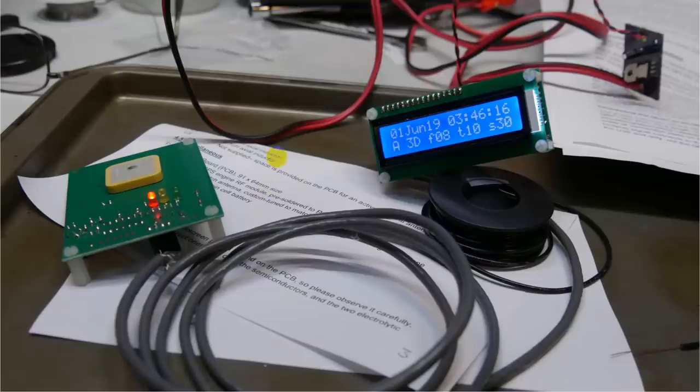Here is the finished clock. You can see the cable that I used here. And this is a little 5-volt regulator. We've got 12 volts coming in, 5 volts coming out, and that 5 volts comes in to the clock. And then the 5 volts also goes over here, and it's regulated. This part up here works at 5 volts, this part at 3.3. Now, what these components are for here is to do a conversion of the data that comes out of here to TTL logic, 5-volt logic, and that comes down into here, makes it easier.